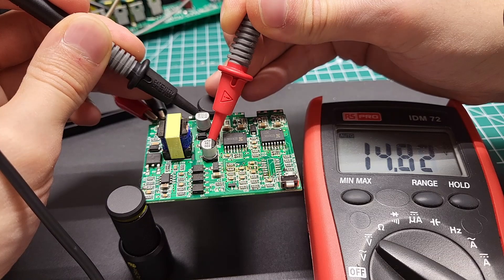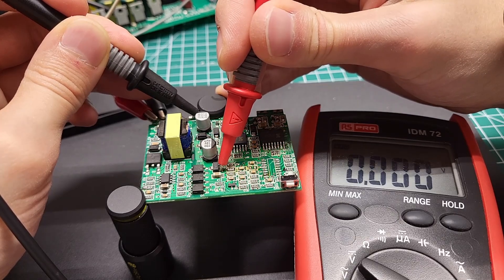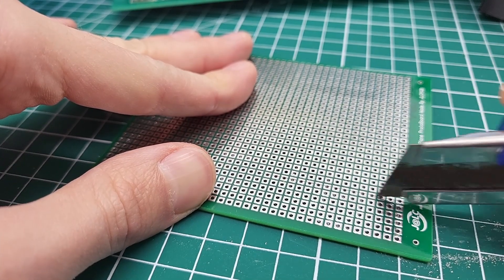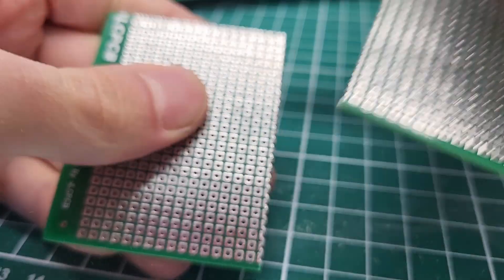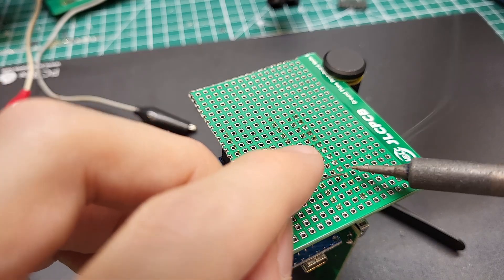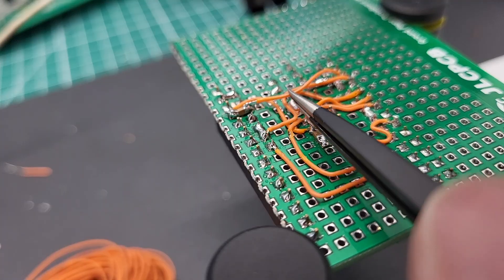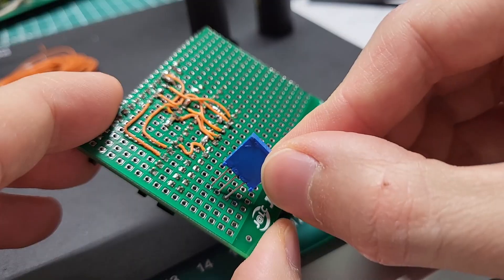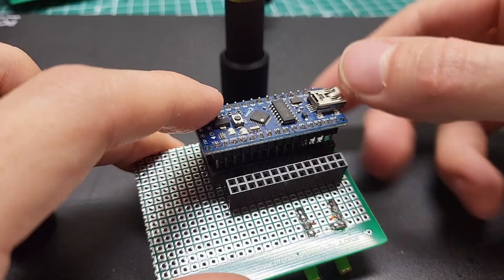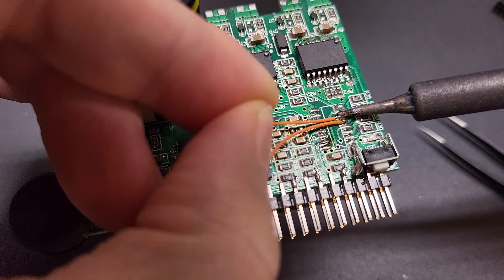A quick check confirms the circuit is now delivering 15 volts auxiliary power and also the 5 volt line. Then I grab a little prototyping perf board from JLCPCB and start soldering the new Arduino Nano circuit. I add two headers so I can remove it easily if anything goes wrong. I also add two potentiometers so I can control the AC output and adjust both amplitude and frequency. Finally I reconnect the gate driver board to the new microcontroller using a double header — nice and stable.